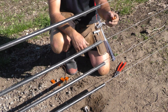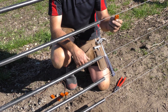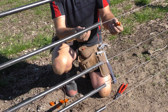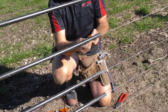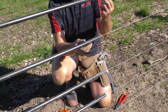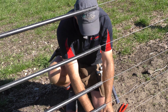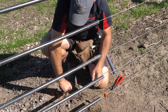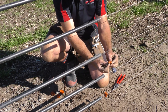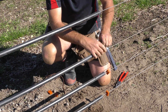Next we've got our clips — they go on the 2.5 wire. These are great, so quick. Plus they've got the advantage over the old style anchor systems where they used to thread down through there. If that perishes, it's hard to replace. With these you can just go and buy them for pre-existing fences and bang them straight on. They just clip straight onto the 2.5 wire — they've got a wee cut through there, just push them straight on.